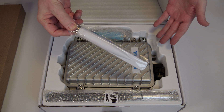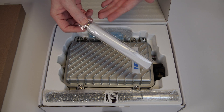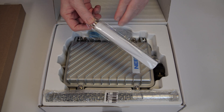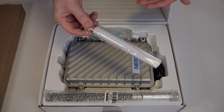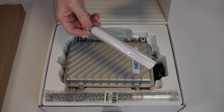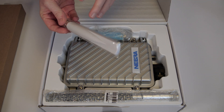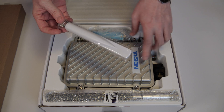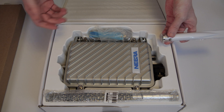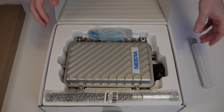You could technically get an external power supply, skip the network wire, and connect the hotspot via Wi-Fi to your home network to reach the Helium network. But I don't think it makes much sense because you'll have to run some kind of wire anyway, so you might as well use the network wire for a stable permanent connection. The Wi-Fi antenna simply gets screwed on the bottom of the unit. There's no need for a surge protector for it since that antenna points downwards and lightning would strike the highest point — the LoRaWAN antenna or the case itself.